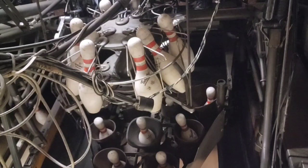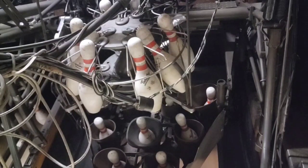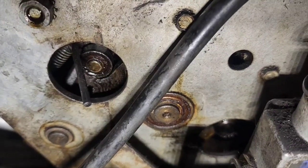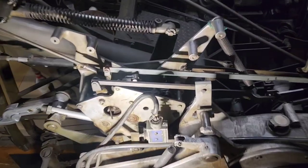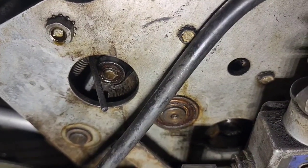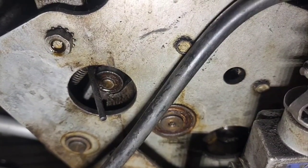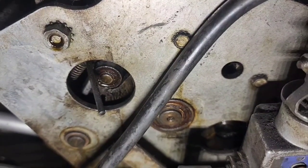All right, stopped on a strike — we actually detected a strike here. We're up at the detector right now, looking through the side cover. Inboard side detector assembly — this is our strike controller, and we are at 90 degrees. The bearing has seated right at the low dwell of the cam here at 90 degrees, so this proves we are in time and properly detecting a strike.